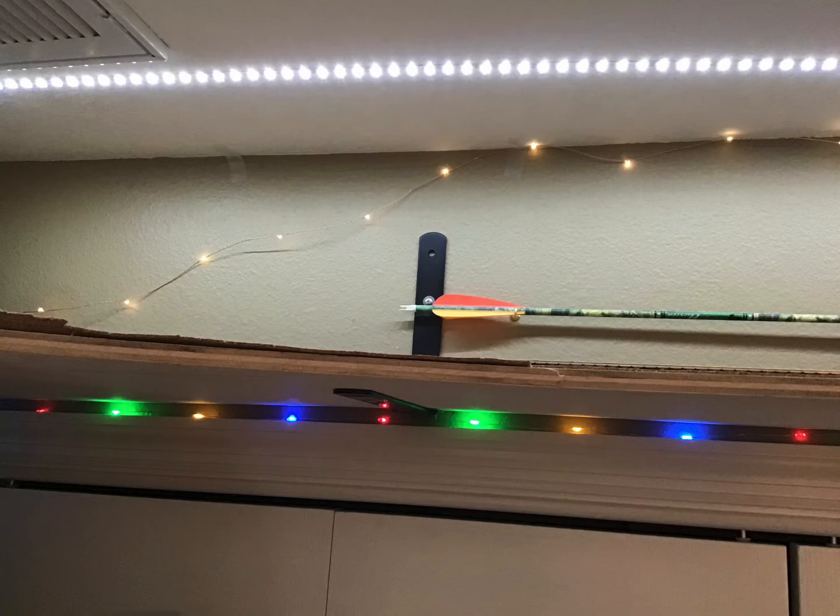and the reason for that is along this one wall there's a closet. In order to do the layout along this wall, I wasn't able to put brackets there. So what I had to do was take the brackets that I'd gotten from Home Depot and take out the braces that were on them. All I had to do was switch them upside down, and I was able to install them, and it gave enough support along this one wall.